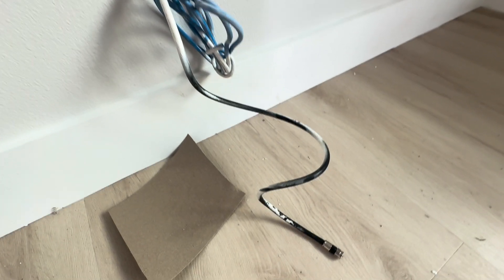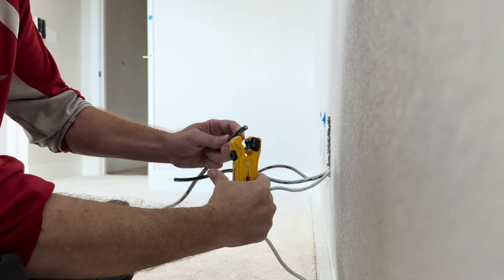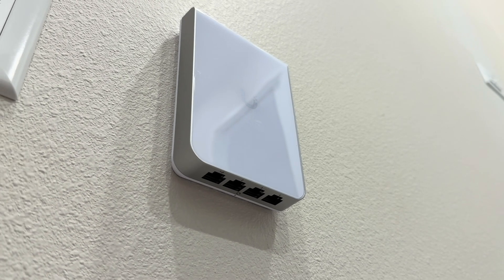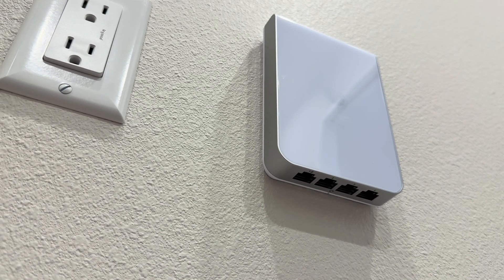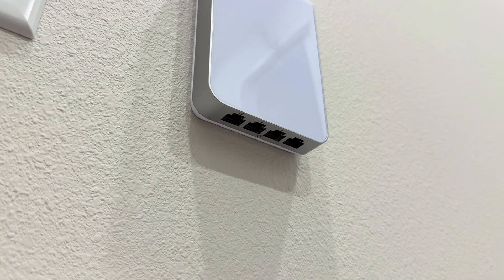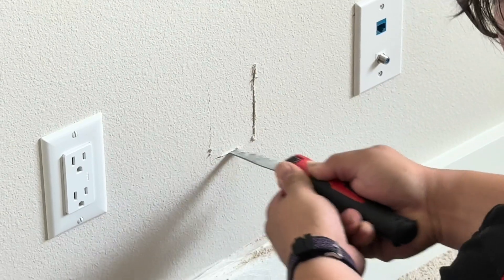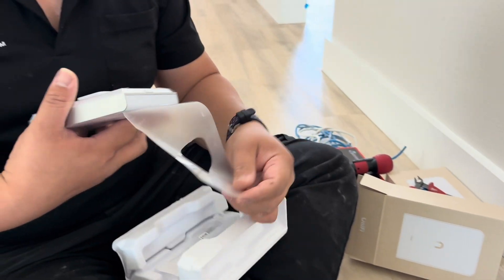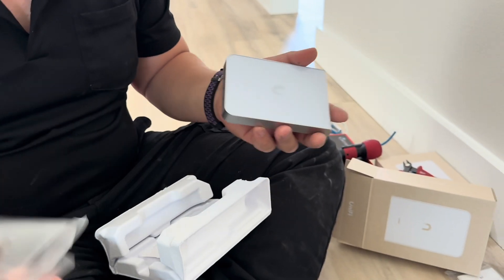While we were away, the cable company also installed their coax cables inside the same blue boxes that we were using, so we've brought a few keystones to accommodate that. One of the other things that's come up is that the homeowner would like the in-wall Wi-Fi system from UniFi installed, and we can't directly place that over the faceplate because it's going to obscure the coax connector. So wherever we need an in-wall UniFi access point, we're just going to cut a whole new outlet right there, load up a low voltage mount, and mount the in-wall system over that. If they later remove this, we'll just put a blank faceplate over the outlet we've cut.